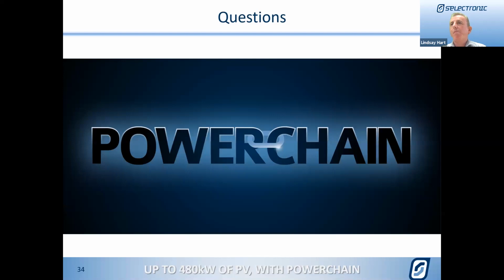If we're talking about distance between the SP Pros and the managed AC coupled, the RS485 communications that runs between those goes up to 100 metres for RS485 connection. So that would be for all ABBs, that would be the maximum distance there. If we're talking Fronius, that then is the distance to the first manager. Subsequent Fronius units talk via their SolarNet connection, and those go up to the specifications of the SolarNet link.